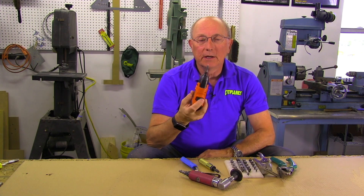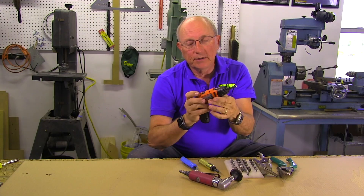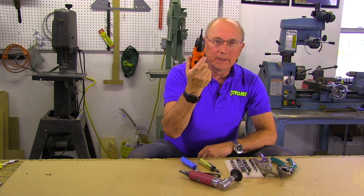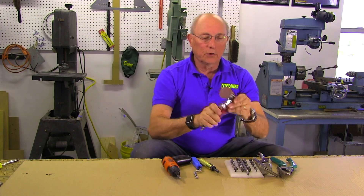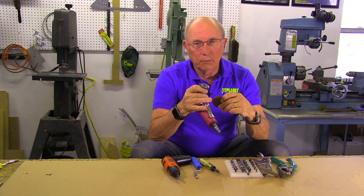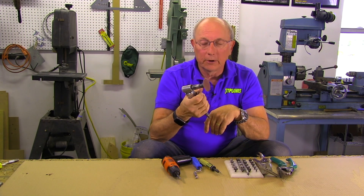This is my favorite deburring tool of all — a one-hole deburring bit which you can buy from aircraft tool suppliers. You put it in an inexpensive Black & Decker type electric screwdriver, it turns nice and slow, and about three turns and you'll have deburred the hole just about perfectly. These are really inexpensive — the bit probably costs more than the driver. The last thing I want to show you is a die grinder. You'll find straight and angled die grinders, and you put various grits of sandpaper or Scotch-Brite on the end. You can use these for deburring and also for shaping metal — a really handy air tool for helping you shape your metal parts.